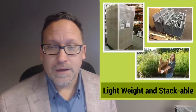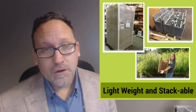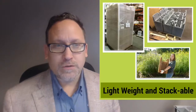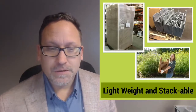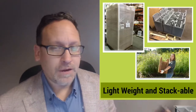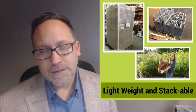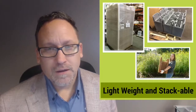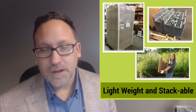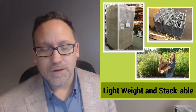Another really great aspect of these is how easily they are to package and maneuver. We're able to put 450 of those on one pallet, which gives you 450 square feet of face on your slope or wall. If you were doing the same amount of area with a solid wall block, you'd be at about eight to nine tons of material. So it's a whole lot less expensive to ship and a lot easier to move around. You can move and unload these completely by hand — they weigh three pounds per block.